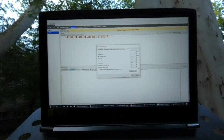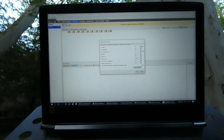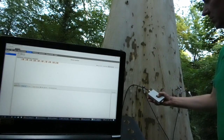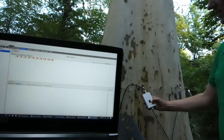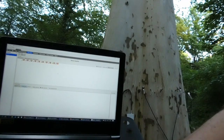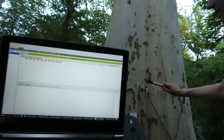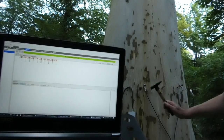Let's start the communication — now we are going to measure the time data. For this reason I need to switch on the battery box. The red LED is blinking indicating Bluetooth is not ready. When it is steady, it means the battery is okay and the connection is fine. If I press start, this green background indicates the connection is okay. Now I am ready to hit 3 times on sensor number 1.